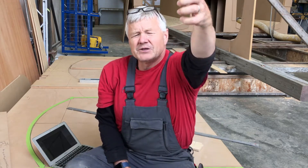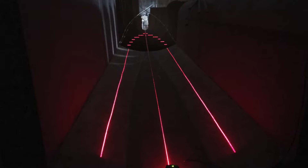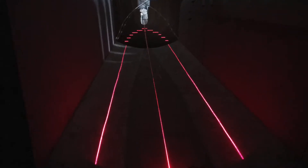Same with the keel — we know the depth of our keel, and then we know our bow stem needs to come up. We're projecting baselines everywhere. We need some kind of reference to measure in from, to measure up from. Everything has to be referenced somehow. Nothing is square, nothing is truly plumb on a boat. However, our baseline and our reference lines are always square and plumb. So we can project every two feet forward — we can project how far in do we want to come. Rhino is great, and then on the shop floor we're also just projecting lines.